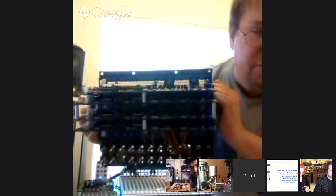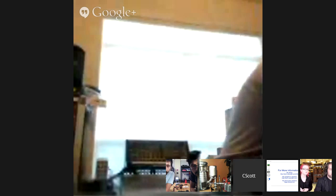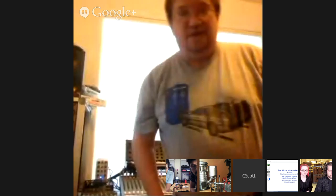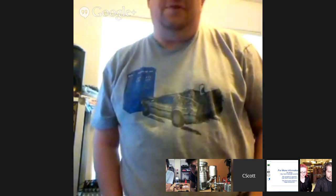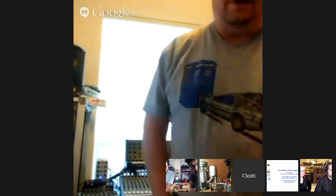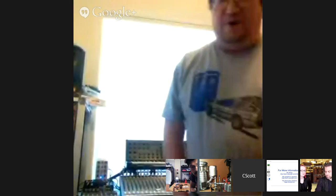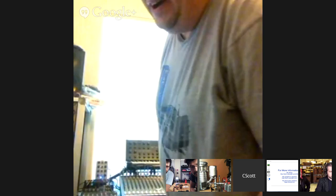Here's a quick one. I'll discuss this one in another show. This is the Kroby X 3000 components, 99.5% pure analog. Wow. But it takes me a while to hook it up, so I'll show it to you some other time. What's the one digital? Is it like a 7805, or what's the digital thing? Two pieces. There is a PIC 12C508. It's a digital noise generator. That's pretty digital. And there's a 4011 that's just logic to help select a couple of the oscillator waveform states. Can't use a diode for a noise generator? I could, but the part it was replacing was a digital noise generator chip. It was a 17-bit linear feedback shift register, and it was terrible. It would cycle every 3 seconds, and you'd hear it. All right, I agree.